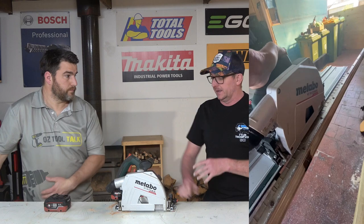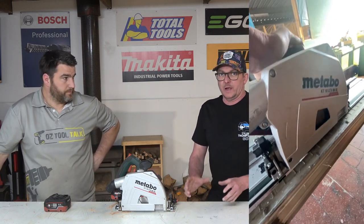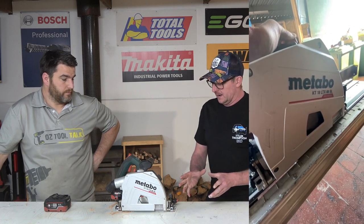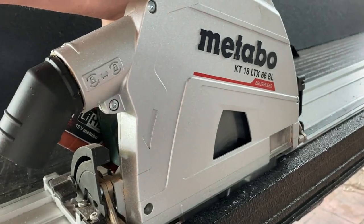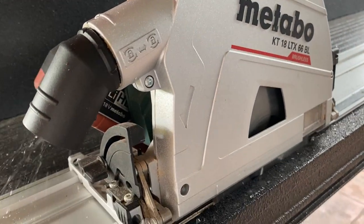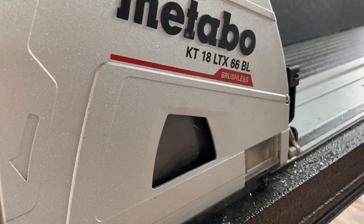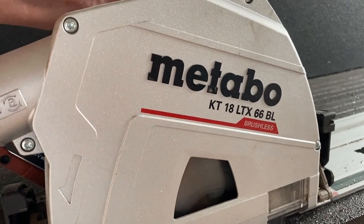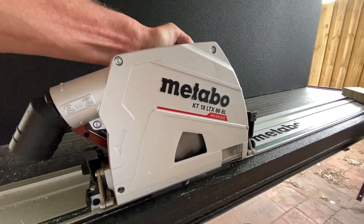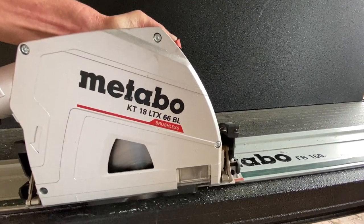After we changed the blades, I used this for aluminium — one of the main jobs was cutting the tray down on the Triton. I was apprehensive, but I dropped the track, put an ally blade on, and it cut beautifully. When you think about this, it's not just woodworking. I'm not sure if Metabo will have a heart attack, but it's a thin sheet ally blade and it worked fine. Would I use it as a metal saw every day? No. But it absolutely did the job.